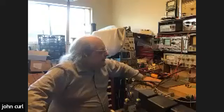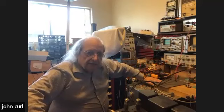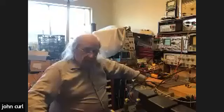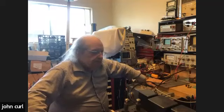But back 80 years ago, more than 80 years ago, they said harmonic distortion, as tested by this machine, can fool you. They knew back in those days that a THD measurement of below, and in those days it wasn't 0.01, which is here, it was 10 times higher, like a tenth of a percent. He said, well, you know, it should be perfectly okay. Well, it depends. If it's seventh harmonic, I promise you it isn't any good. If it's second harmonic, maybe you can live with it. We've been doing it forever.